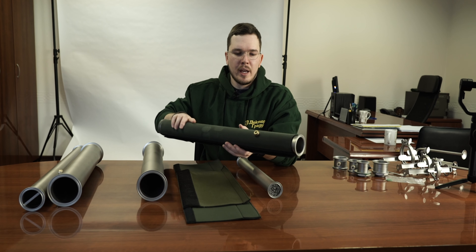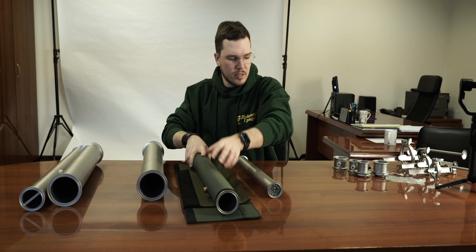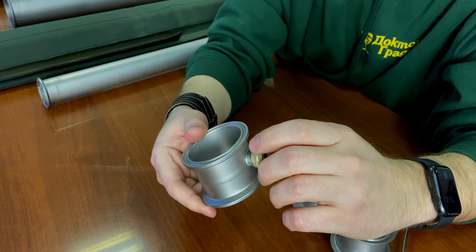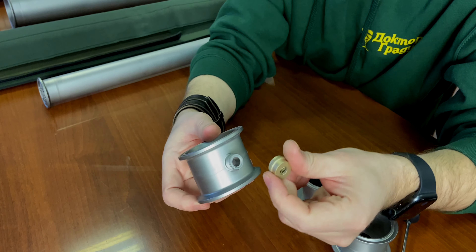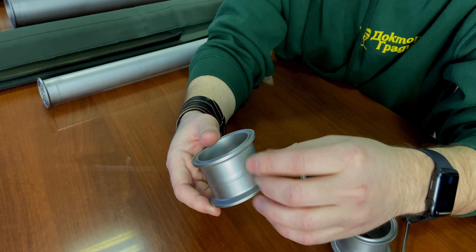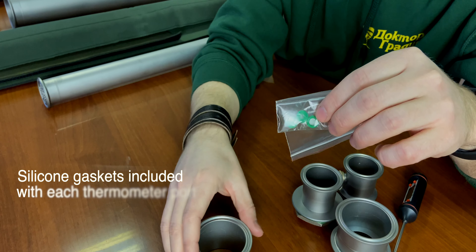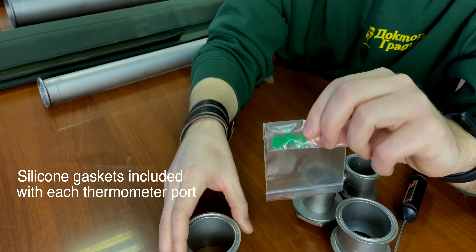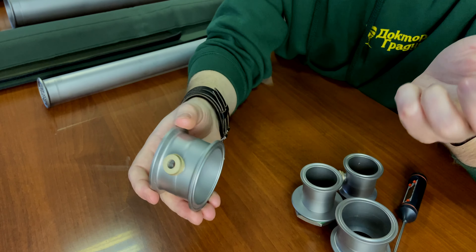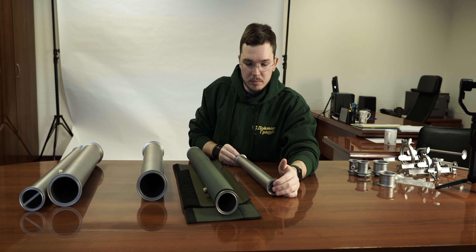We always love to add a thermometer port. It's a bit hard to show on this big extension, so I'll show you on this small unit. As you can see, this thermometer support is universal and we can add it just the way you like. With it you are able to install a 4 millimeter or 6 millimeter probe inside the extension or any other place to monitor the temperature. This is the gasket kit included with any universal thermometer port — two sizes, plus an end cap to seal the connection if you don't want to use it, for example during pot still distillation.